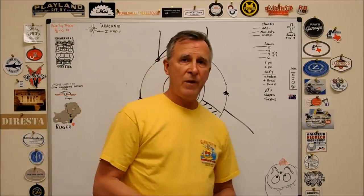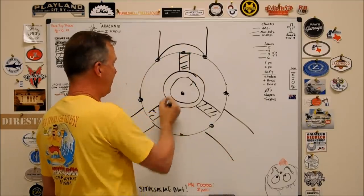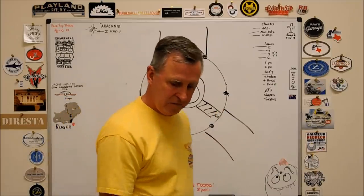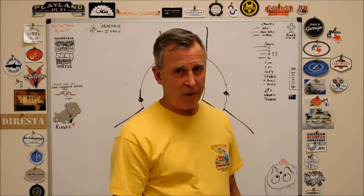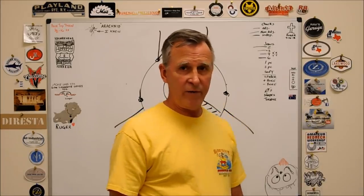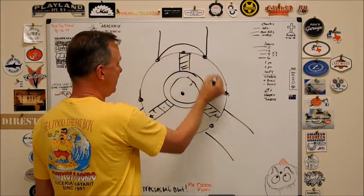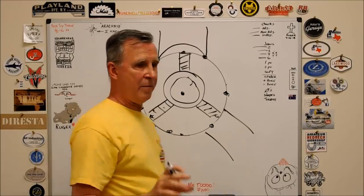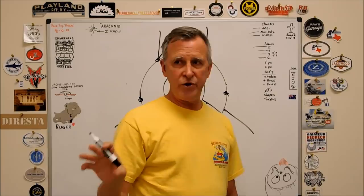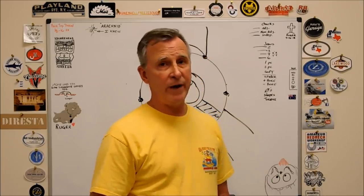Close the jaws. That diameter is now smaller than it was before because the grip points of the spider make a smaller triangle. The jaws just closed up. Let's say you stopped at 150. You don't stop at 150 this time. If you're coming back, stop at 152 or 148, however you're reading your dial. Now you got away from that single point contact and you have this. Your part may not fit ideally or slop around with the jaws clamped shut, but when you take that spider out and put that part in, you got money right there.